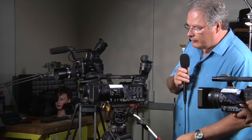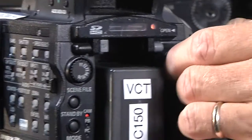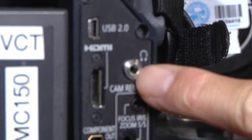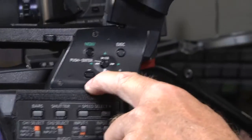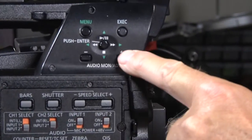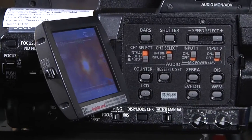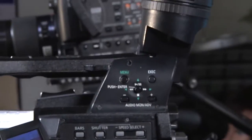The next thing you're going to want to do is plug in some headphones. The headphones get plugged in at the back here under this plastic cover. You should always wear headphones because sometimes you're going to get interference through wireless communications — telephones, refrigerators, airplanes can cause interference — and you won't necessarily hear it in the air or you might be looking away and not see it on the screen. Here is the audio monitor plus or minus to set the volume for your headphones. Always set the volume according to the line on the screen for your input, then adjust your headphones to listen comfortably.